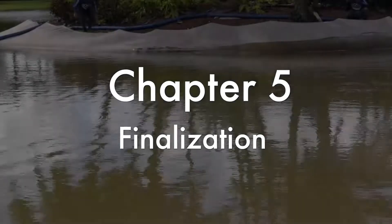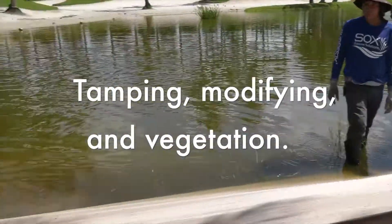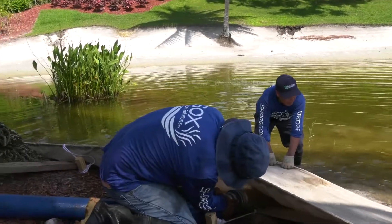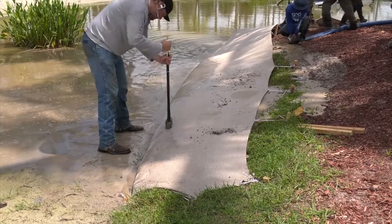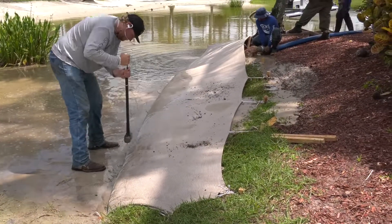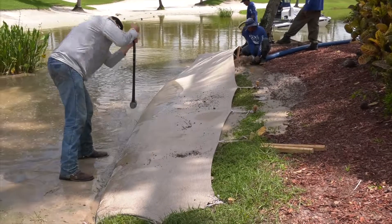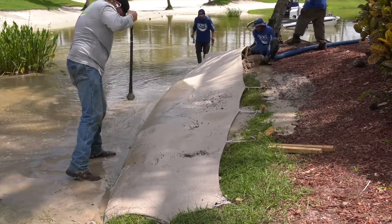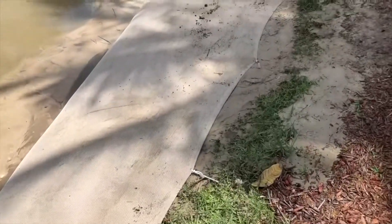Chapter 5: Finalization — tamping, modifying, and vegetation. When prepping the socks for finalization, make sure to fill any soft spot to ensure a fully stable shoreline. After ensuring the socks are completely filled, be sure to adjust the pitch of the shoreline based on the request of the client. When adjusting the socks, make sure that the bull nose of the socks is at least four to six inches above the adjacent waterline. Once all needed adjustments are made, then be sure to completely pound the upper row of stakes underneath the surface.